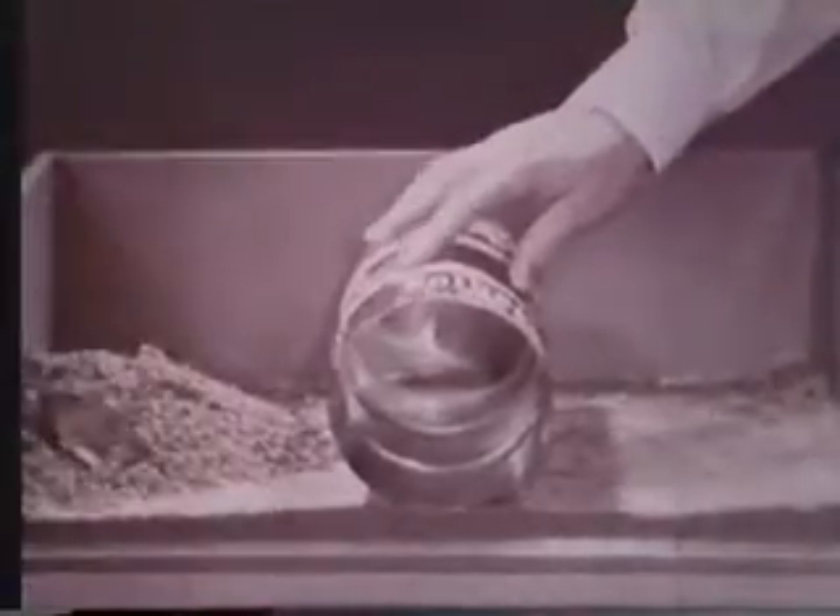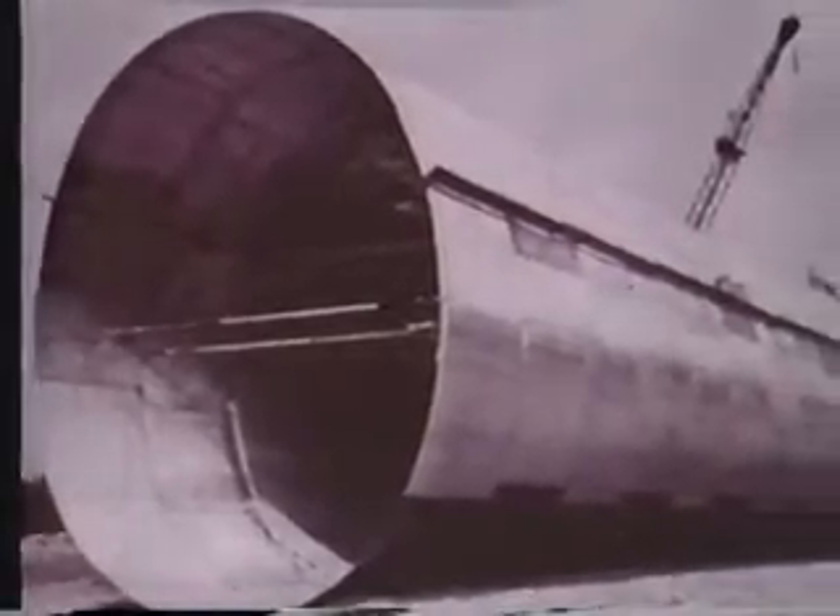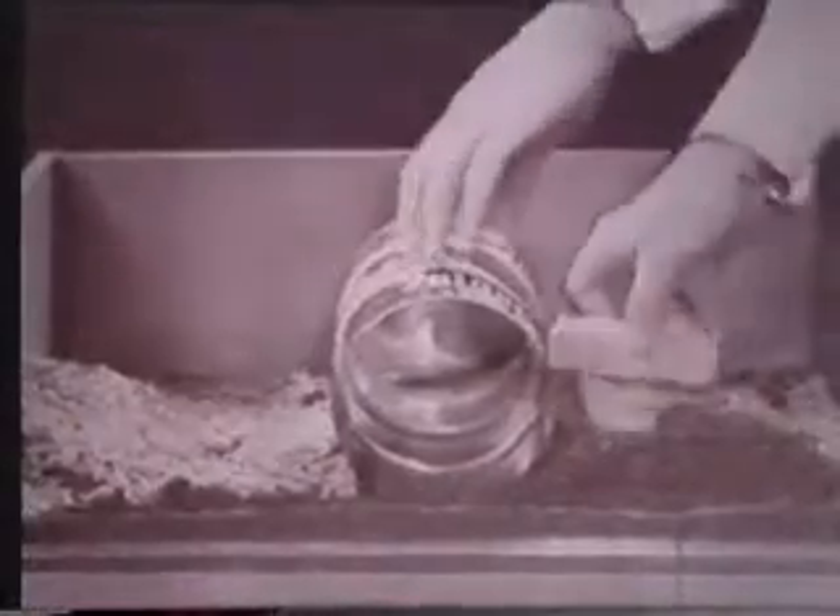The flexible corrugated steel ring of desired shape and size is then constructed on the prepared foundation. Sizes can range from 6 inches up to big structures, 16 feet to 24 feet in diameter. The backfill material, which should be of the same quality as the base, is spread out in 6-inch lifts or layers. It is tamped and worked well under the sides or haunches of the structure. In actual construction, the material near the pipe should be thoroughly compacted with vibrating or mechanical equipment. If the backfill material becomes too dry for compaction, it is advisable to bring it up to optimal moisture content by sprinkling lightly with water.